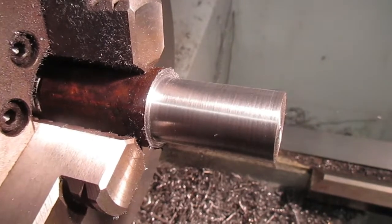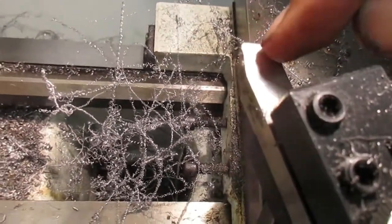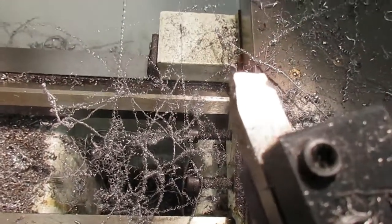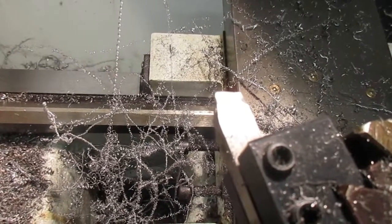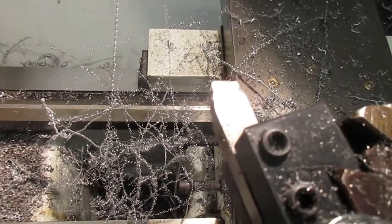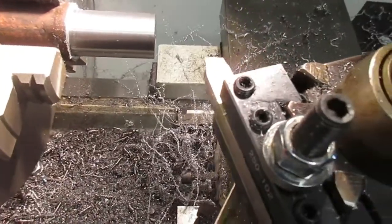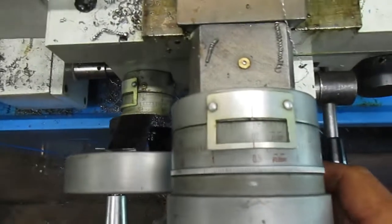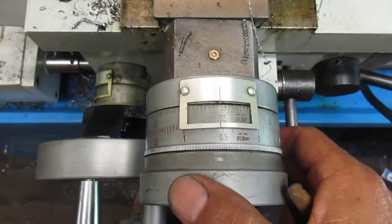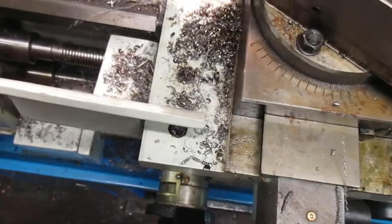I don't know — I might be able to change this a little bit. I need to put a chip breaker in there, and I'm thinking I might square that up a bit right in there. That's kind of where I'm at at this point. Running it in again so you don't get that fuzzy feathery crap. Let's go in 10 thousandths with it, just for fun. All right, back her off a bit.